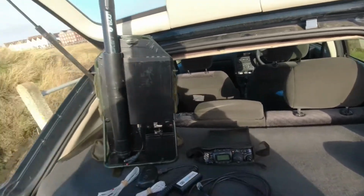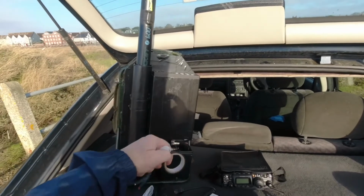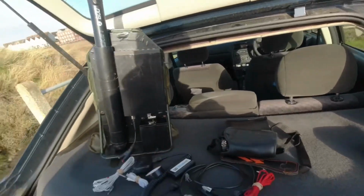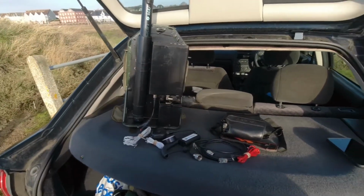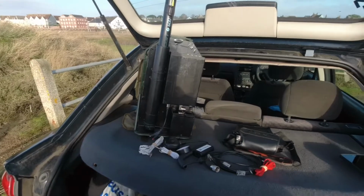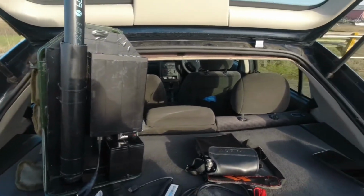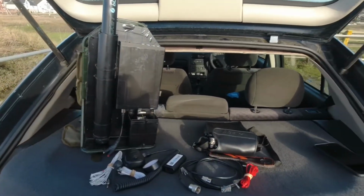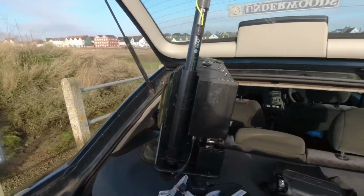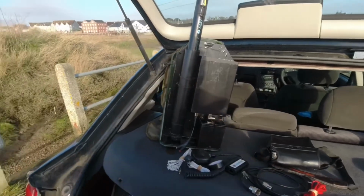That's the power cable. And I'm going to attach the radiating element to the top of the pole, just with a little bit of PVC tape, and then the FT817 will go around my neck. I'm not going to log this live, but I'm going to film it and capture everything, and then I can go back and record in my log anybody that I manage to work. If this doesn't work, then I've also got the 857 in the back of the car, and I'll go out the road and operate from my normal high point with a full quarter wave 17 foot MFJ whip.